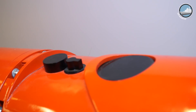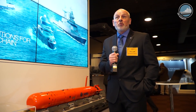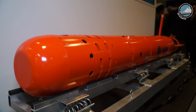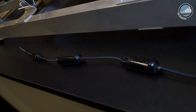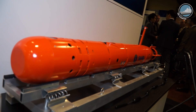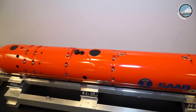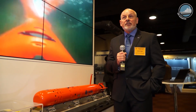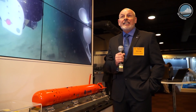The AUV-62 is a derivative of the Type 62 torpedo — it's an anti-submarine warfare target. It operates autonomously for between eight and twelve hours, and acts as both an active and passive sonar acoustic target. It replicates the submarine that the trainer wants it to be, so you can effectively dial in the signature of the submarine you want it to have. After the exercise, you can download all the data and analyse how well the combatants performed.